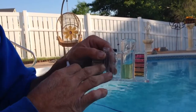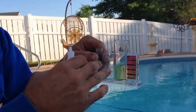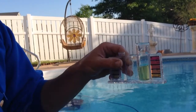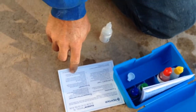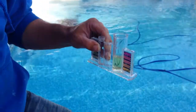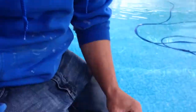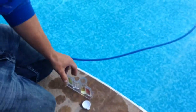Again, you can't do anything until the chlorine is ideal because these are going to fluctuate. Right. So again, it doesn't tell you how many drops. A lot of people will take a permanent marker and write 12-17 and they'll know that that's good. Yeah, 12 to 17. And that's basically how you test your water, and then you make adjustments from there.